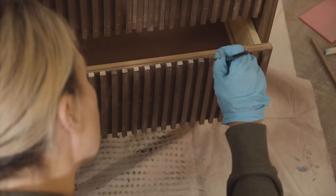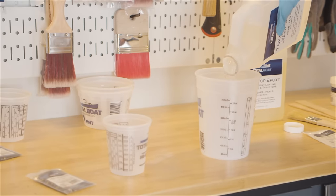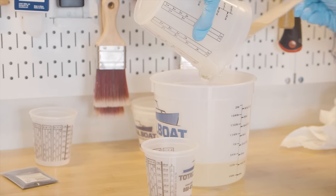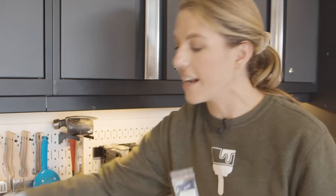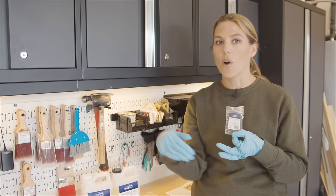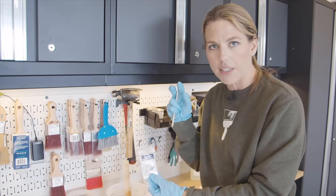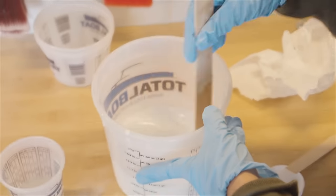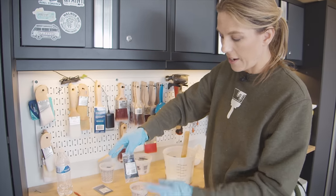I also used an artist brush to stain the tops of all the fluting and do any little touch-ups needed. For the second coat this is where the marbling comes in — I need twice as much epoxy, so I made 24 ounces this time, and I also need a separate cup for my veining. The kit comes with light gray and black gray which you can mix together for dramatic veining. I'm going with just light gray to see how that goes. For my white layer I'm adding a little silver pearl mica powder to make it sparkle and be iridescent — it mimics the look of marble. I set some clear epoxy aside and added the light gray mica powder for the marbling.